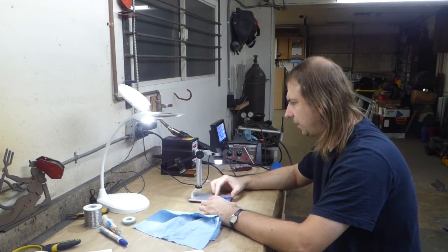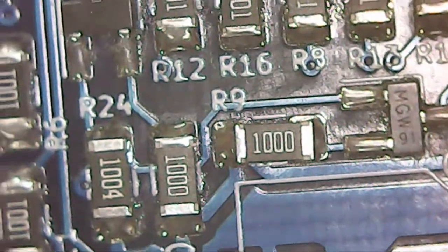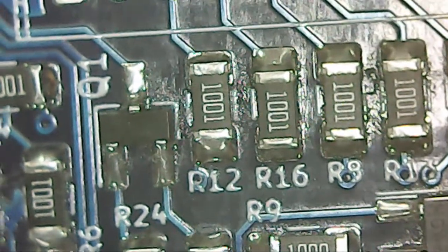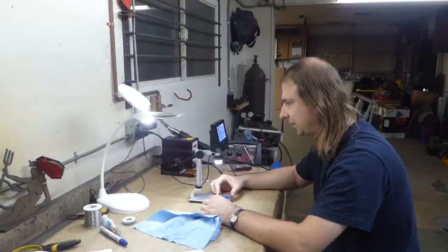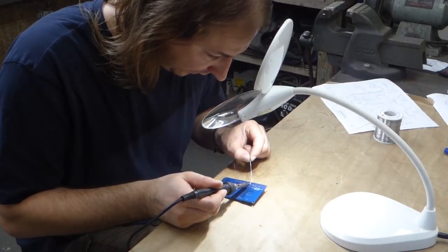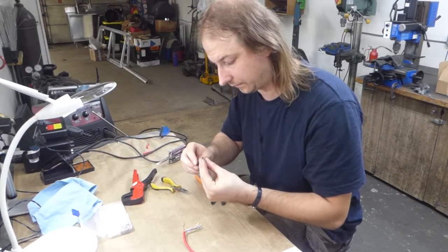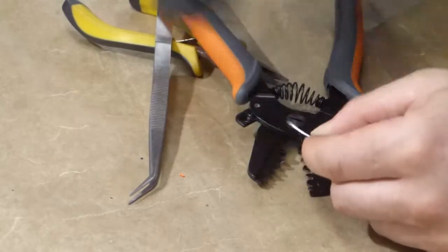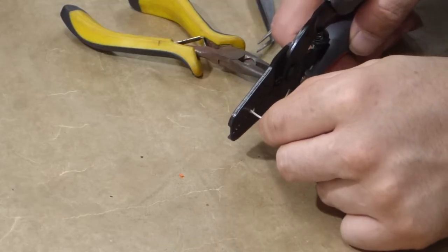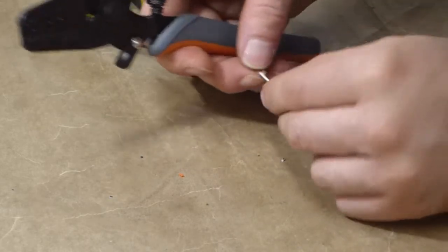Now, just to make sure that all this stuff is soldered properly, I went back off camera and fixed a bunch of the joints. I used way too much solder paste, so a lot of the components started floating away. Oops. Now, just solder on the connectors for the LCD screens. Now I'm whipping up a very quick 8-pin cable to connect the controller to the LCD screen. Just using these Molex connectors to match the ones I used on the board.